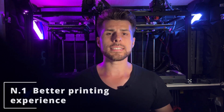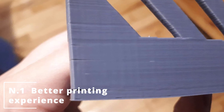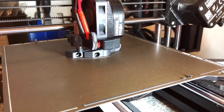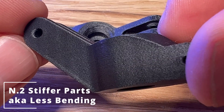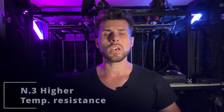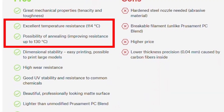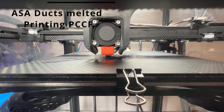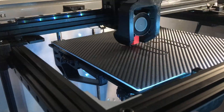When you combine a strong polymer with tiny carbon fibers, you achieve four things. First, these fibers reduce shrinking typical of high-temp materials, eliminating warping and delaminations. This means you will have an easier printing experience even with open-style printers and less tuning when designing and slicing parts, worrying less about holes and big parts being dimensionally inaccurate. Second, carbon particles increase the stiffness of the printed part, meaning it will bend less when stressed. Third, carbon particles enable the printed part to resist higher temperatures, meaning you can put parts in stressful environments — think engine bays in summer or fan ducts near the heat block on an enclosed 3D printer. Ever saw ABS ducts melt? Making those ducts in PCCF eliminates the issue.